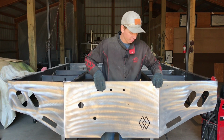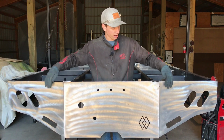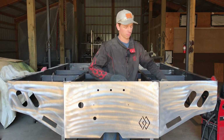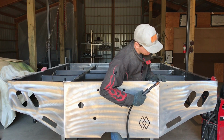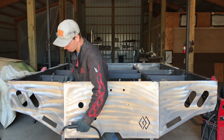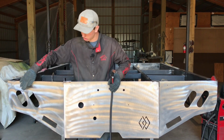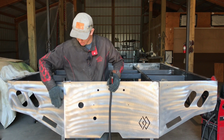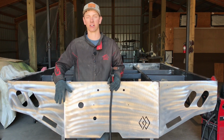So once you have this correctly placed in here and your seam matches up nicely, you're going to want to tack it in approximately 3 positions on each seam. So I would tack the top corner here, in the middle, and then at the corner, and do the same thing over here. Obviously this is an angled outside corner, but just make sure that your two pieces are lined up nicely, because we're going to put our back bracing on here next.